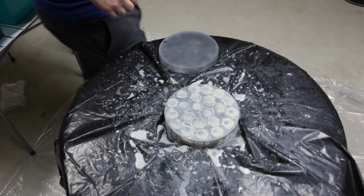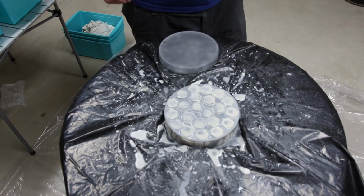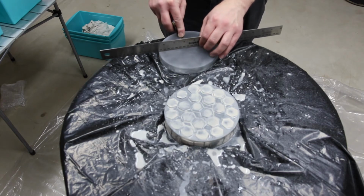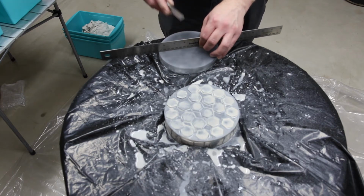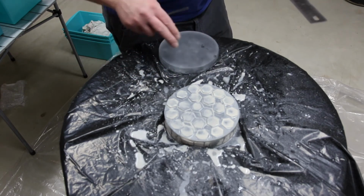Alright, so I'm getting really close here. I just took a measurement after a few more wets, and using my straight edge and some of my feeler gauges, I can barely sneak the very tip of the feeler gauge under when I have a combination of 22 and 23 thousandths. So we're at about 45 thousandths of an inch deep.